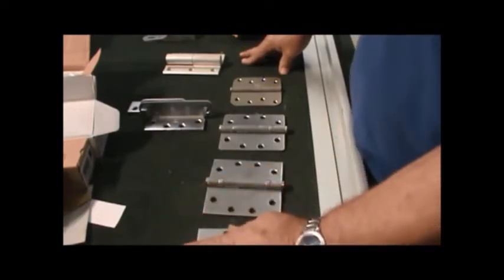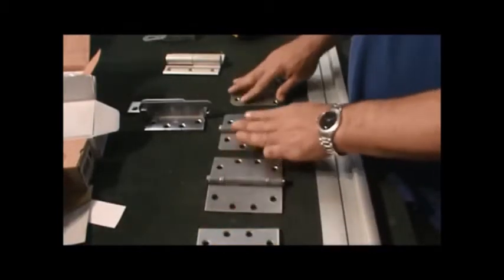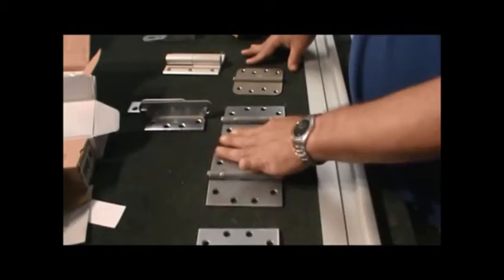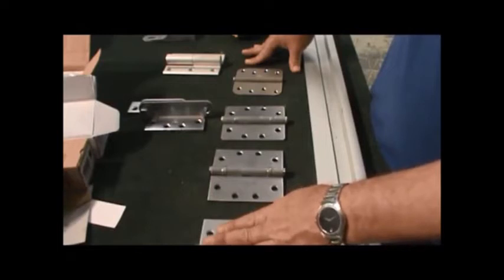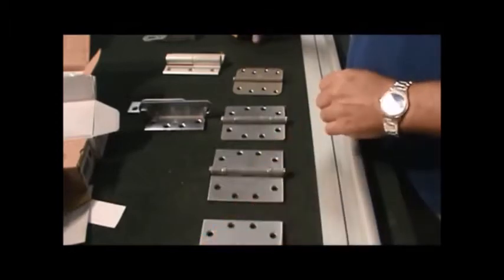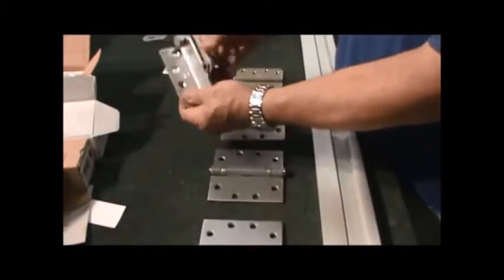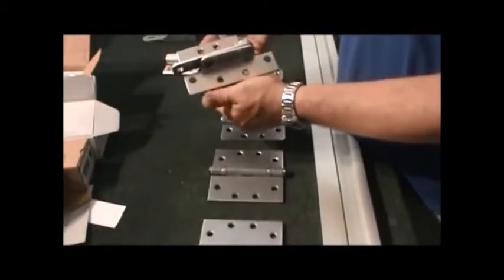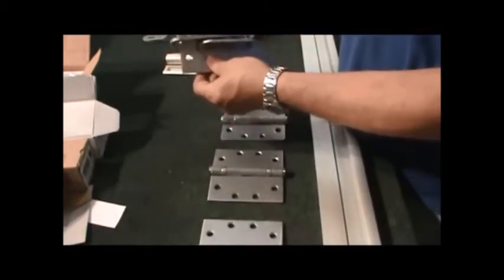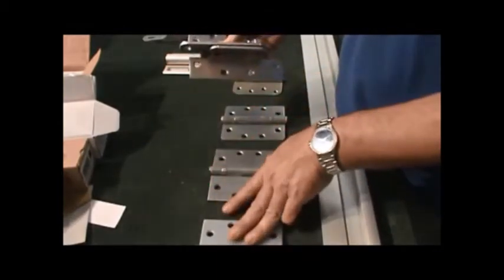The other heavy duty application that you're going to see is when somebody is using a 42 inch door and above, sometimes an 18 gauge, or they get down to 16 or 14 gauge doors, or, like penitentiary doors, have a 6 inch on center rib, which makes the door awfully heavy. Well, they have a hinge helper, it's called, Hager makes them, and they go up in the top corner. These actually help hold the extra weight of the door and keep the hinges from taking all the load.